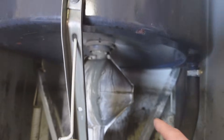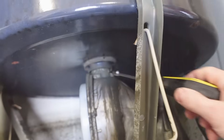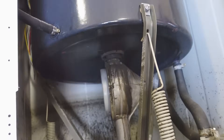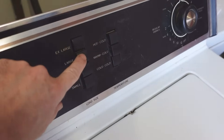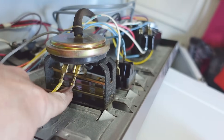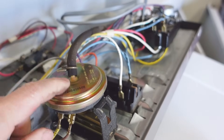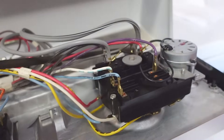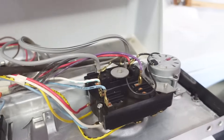That's basically all the action it could do, plus of course letting in hot and cold water. We had a guy servicing it 4 years ago and he made it work better, but he said the bearing is worn out and you can't get replacement parts anymore. It's gotten to the point where it just makes horrible noises when it tries to spin. The brains of this washer are also super simple: we have the level and temperature controls, and the level switch — basically these 4 settings say how much pressure this sensor needs from the bottom of the tub before it says it's full. This just controls which solenoids turn on for hot, cold, or both. And this is a timer that basically all it does is turn on, let water in, and turn on the motor in either direction.